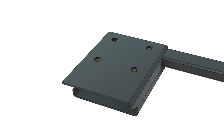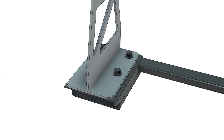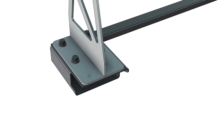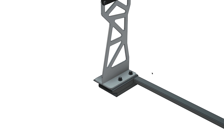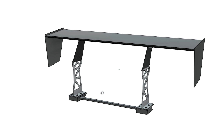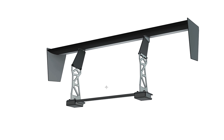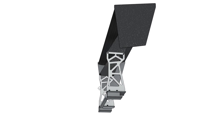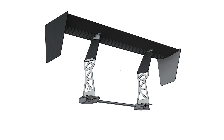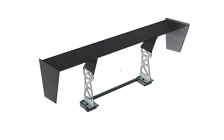The next piece of the puzzle is the base plate for the wing upright, which will be made out of aluminum, and we will bolt this down with four M12 bolts. The last piece for today's project is the wing upright itself, which we will weld down to this base plate, making it all one piece. From here I got a little bit carried away — I designed the rest of the wing, kind of winged it on design — but overall this should give you guys an idea of what we're working with. I've done a lot of material removal on the uprights themselves to keep them nice and lightweight, and I believe I'm going to make them out of 3/16ths or a quarter inch aluminum plate.